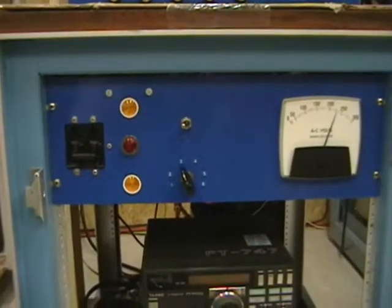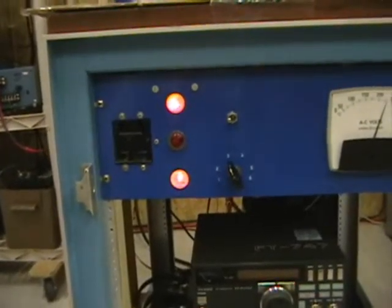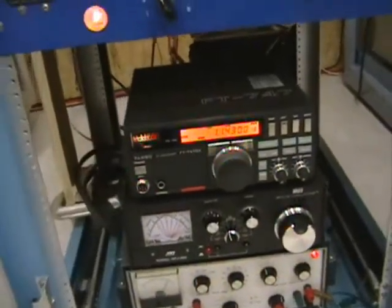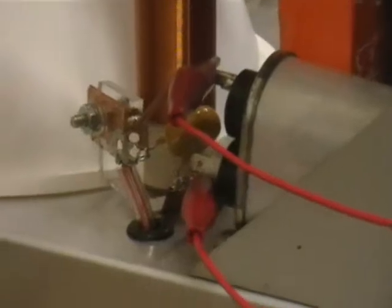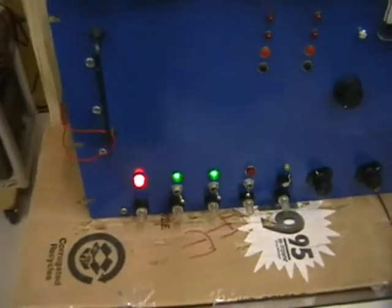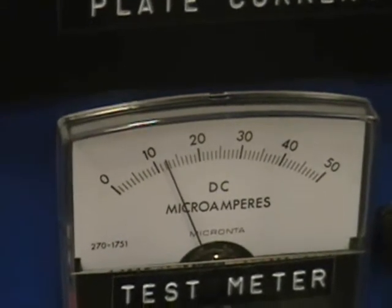This is the control panel for the power supply. Turning on the left-hand circuit breaker turns on 240-volt high voltage to the input of the power transformer, allowing the system to function. The 747 transceiver now shows a frequency of 11.43 MHz, which is where it is adjusted at the present time. To operate the system, we have a shorting wire connected across the high voltage power line, which shorts it to ground so there is no possibility of turning the unit on and harming the operator. We now turn on the switch for the fans and the switch for the filament for the 7C24 amplifier tube, which will warm up in about 20 seconds. As soon as the meter comes up to about 18 on the scale, we will be ready to go.